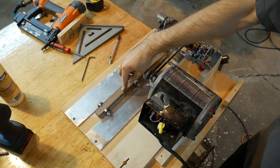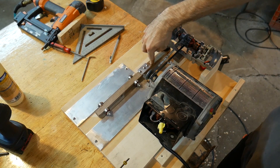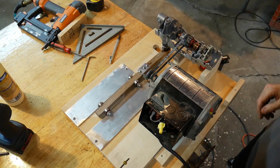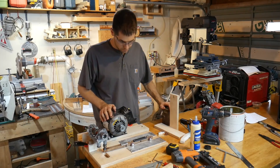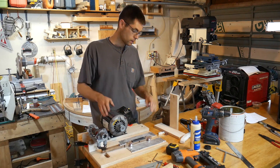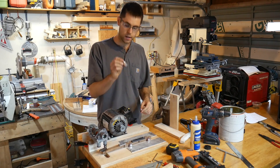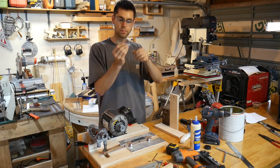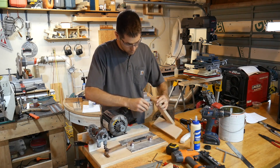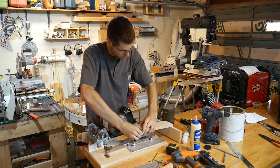We've got it set up pretty well now. We've got our cart here which rides back and forth. These keep it in line side to side but have just a little bit of play. We have two fastened to this piece and then this one is loose so it can flex. We have a double joint connection. It took a lot more work than I expected but we did get it together and it works pretty well — not too noisy, seems nice and smooth. I have my piece that's going to rub on top of the sample. I milled a slot in it with a V bottom so a ball bearing can fit in there and have some play, and then another one on the bottom of this piece, so they fit together and can move.